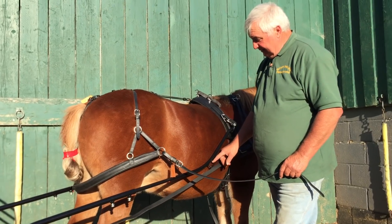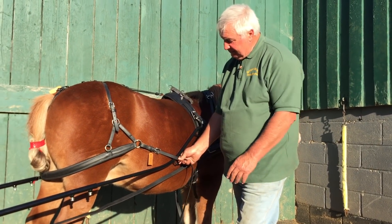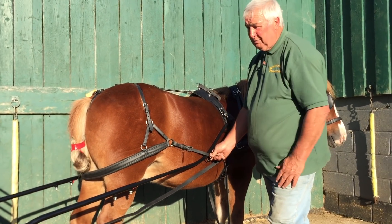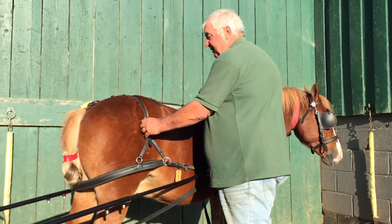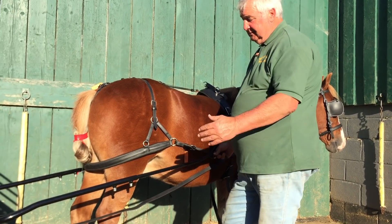What you have to take into account is the shape of your shelves. These shelves here only have one fitting and it's up here, so if you look at the angle of that when it's fixed on there, there is a pull down and yet there is a hold back — a nice pull down but it's not pulling on here, it's comfortable. And that's the way it will be.